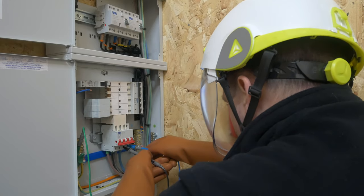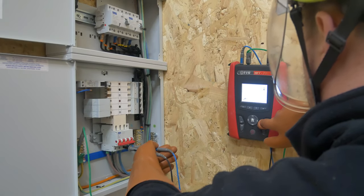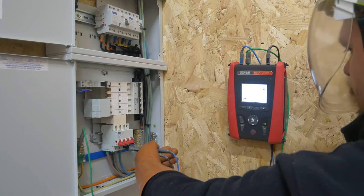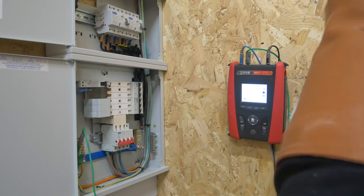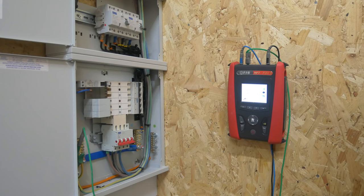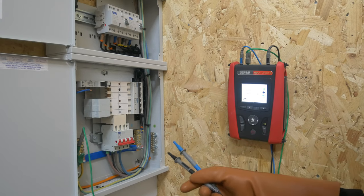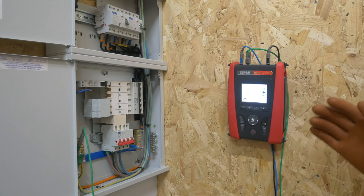And then lastly, between L3 and protective earth. You can see it's running through that process again. We've got the neutral conductor on — we are actually checking it to the earth largely. It's giving us the value between neutral as well, just as a byproduct of the way the test works, but we've already got what I would class as more accurate measurements for that by doing it on the no-trip method. You can see here again 0.37, ever so slightly higher. The tiny probes going onto the contacts of the screw heads will move about, and you can repeat it if you want and see if you get a different value — but I'm happy with those, very consistent.